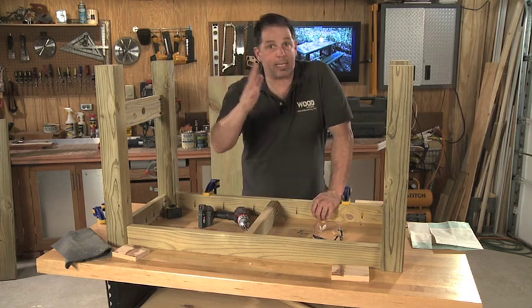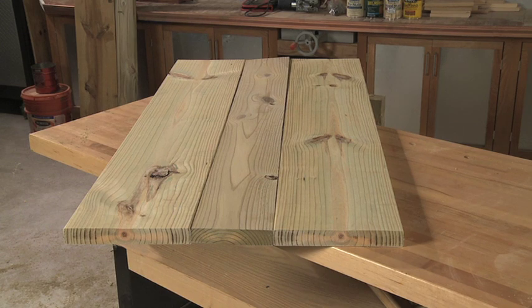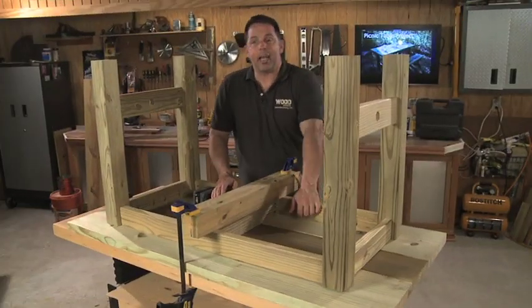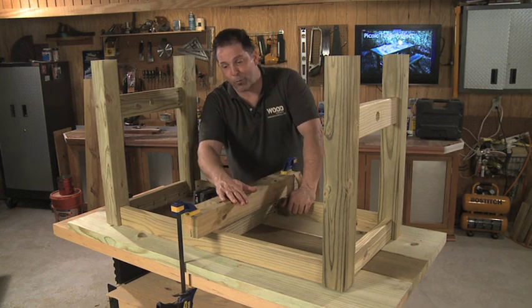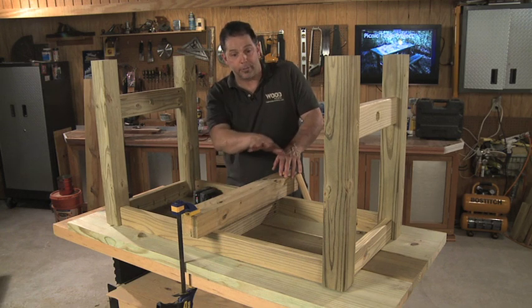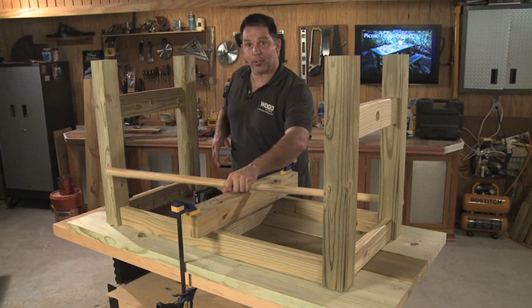Speaking of the top, let's talk about how we put that together. The top is pretty simple — it's made of three pieces of pressure treated southern pine: a 2x8 surrounded on either side by 2x12s, all three are 59 and a half inches long. I looked for boards reasonably free of knots and major imperfections, but I still wanted the top to have some character. At this stage, I've taken all the table top pieces, turned them upside down on the workbench, put the base of the table on top of that, and used a 4x4 and a couple of clamps to smoosh it all together. We have to attach all of the boards to the apron with our pocket holes and screws, and also get our magic footrest dowel in place. I've taken all but one screw out of this part of the stretcher.